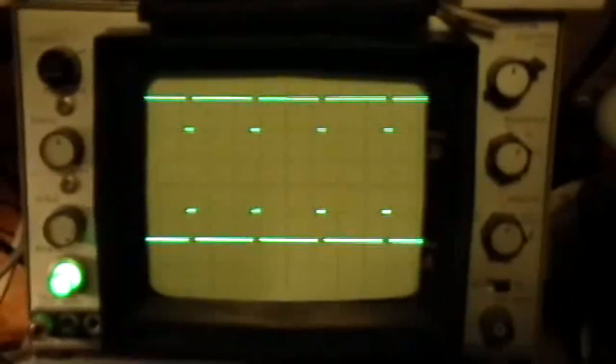The baseline is indicated where that marker is on the right side of the graticule — that's zero volts. I'm turning the duty cycle potentiometer in the other direction, and as you can see, the on time is getting longer and the off time is getting shorter. Right around here is where the thing really likes to run — at about a 90–95% on duty cycle. And as you can also see, it makes a good, clean, sharp pulse. It's a very nice, fast rise time pulse generator.